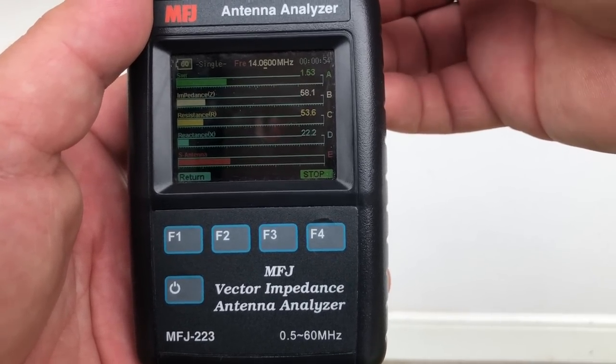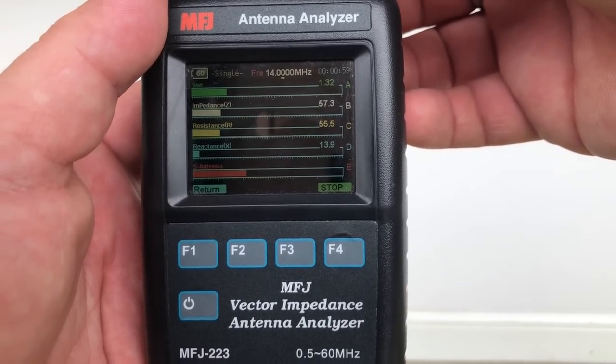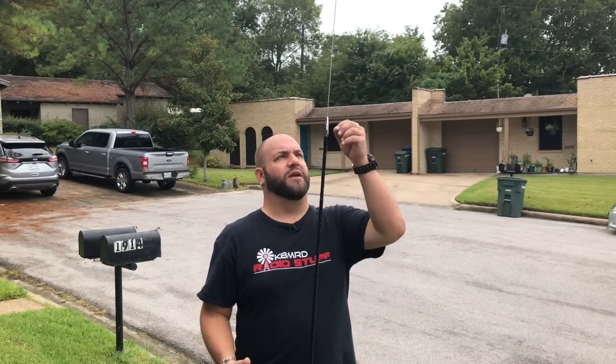On my car it's actually a little bit lower — I'm pretty much at 1.0 SWR right there. Conventional antenna-building wisdom says if something is too low, it's too long, so you'd think shortening it — sliding the whip more into the body of the fiberglass mast — would raise the resonant frequency. Well, that's not happening. It's actually lowering it down into the 13 MHz spectrum when I shorten it any more.